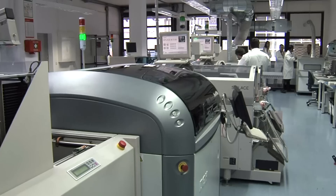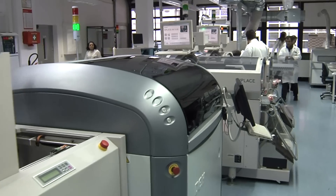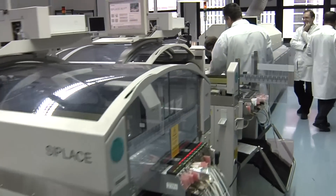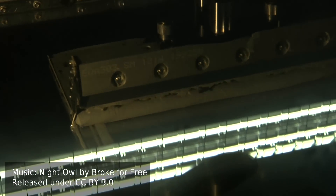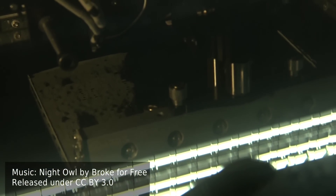Enjoy. And here they are — the sacred halls of Global Components, where every Pandora, rebirth, and gigahertz PCB has come to life, and where also the Pyra PCBs will come to life. First, the solder paste is put onto the PCB pads, which is being done with a stencil and a machine that simply pastes the solder paste onto the PCB.